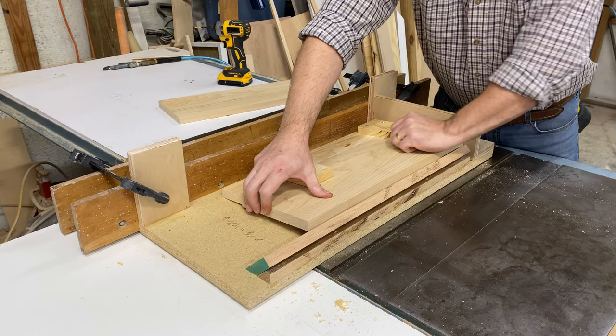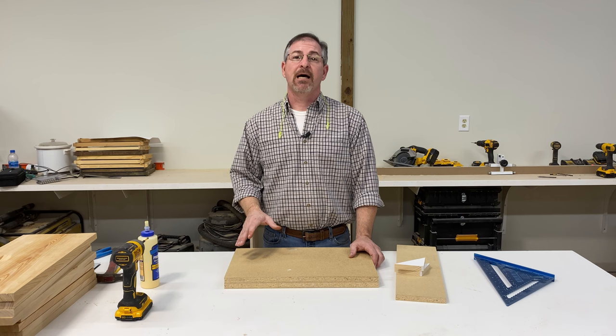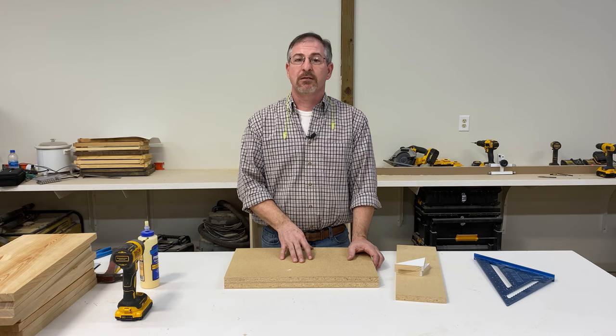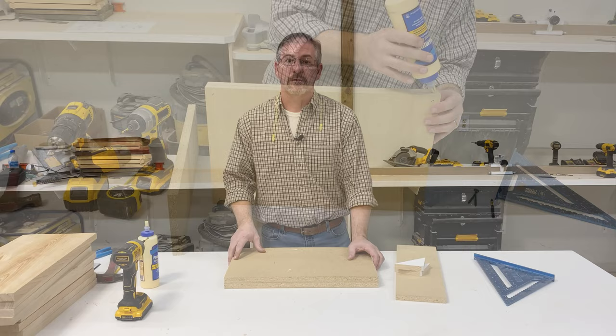We'll set up and do two different size box joints today. One's a 7/8 finger, which is a single pass on the dado. The other is an 1 3/8 finger, which is a double pass on the dado. It'll take a different jig for each size. I'll set that up now, and I'll leave a link to a drawing in the description if you'd like to build one yourself.